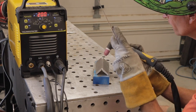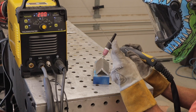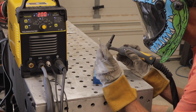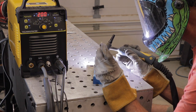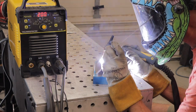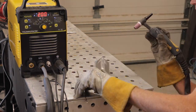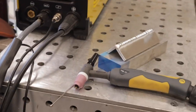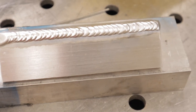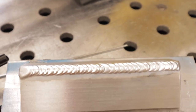Let's get to the review and show you some of the welds — I'll do some different thicknesses and different types of joints. Here we're doing some aluminum TIG welding. I've got some quarter inch plate TIG tacked together and I'm going to run a bead on an outside corner. I've sped up the footage in the middle so you don't have to sit through the whole welding process. And that's how nicely this Hynade welder does on quarter inch — very nice, I'm quite impressed.